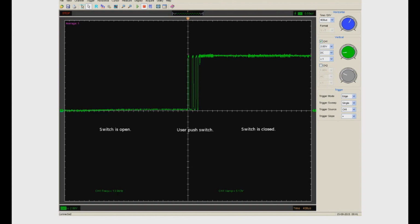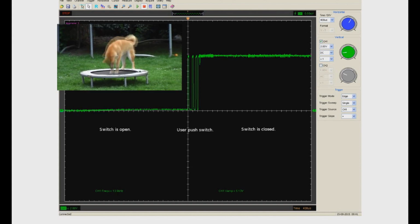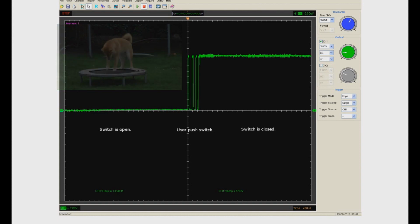The easiest way to eliminate this issue is to use better quality switches and relays with faster bounce times. Otherwise, the only other option is to add a muting circuit to your pedal. Its job would be to ground out the input and output lines of your pedal for a short period of time, specifically right before and after the noisy switch is actuated.